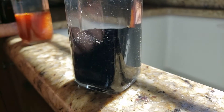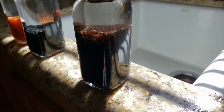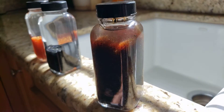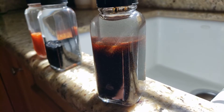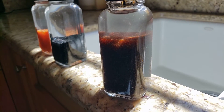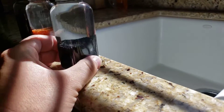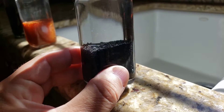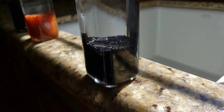That's the big difference between a Hague WaterMax and a mixed bed unit of any brand — the Hague WaterMax has three screens. We also have one other special media, which is the secret weapon in the Hague system, and that's called KDF. KDF is a combination of zinc and copper, and its sole purpose is to pre-filter out the majority of the free chlorine in the top compartment before it comes in contact with the carbon, extending the life of that carbon potentially 95 times longer than the carbon would last by itself.